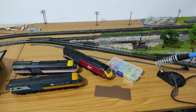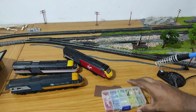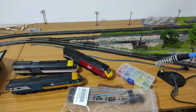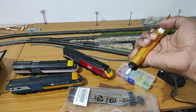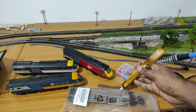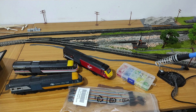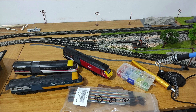Here I want to do something constructive, not destructive. So we have our red LEDs, white LEDs, strip board, and wires. I'll get the resistor later. If you are a bit careless with your soldering as a first timer, get a desoldering pump as well. If you make a mistake, push in the plunger, put it onto the solder joint, heat it up with the iron and press — it sucks out the solder, giving you a second chance. But with soldering it's always best to get it right first time. So let's get into the actual modification.